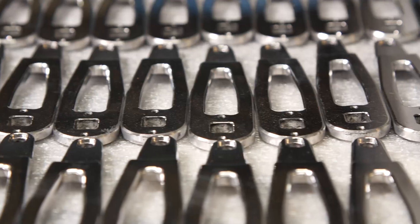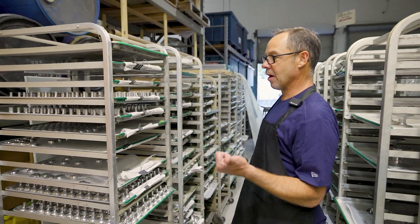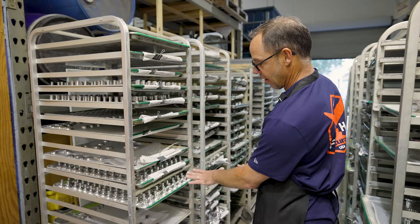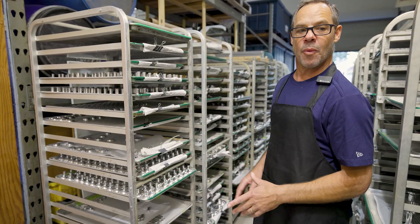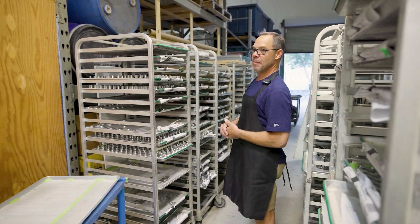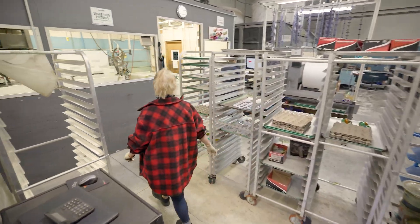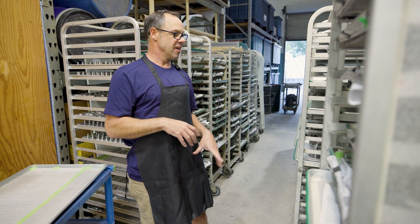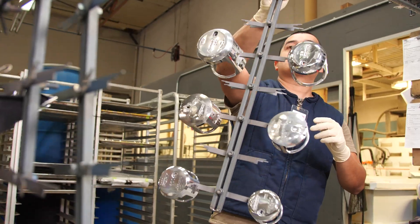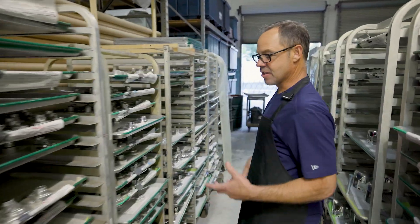So here what we're looking at — these are all the parts that have been produced, turned on a mill or lathe, then polished. They're in the raw state, ready to be anodized. So what we do is, let's say one of our customers calls up and orders 10 BV 500s — all the available parts are here ready to go. A lady comes over, picks and chooses the individual parts, puts them on a tray, they get racked up, and then they go into anodizing. Within about two or three hours, they're done.